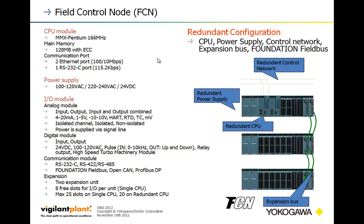There's a wide variety of I/O modules — all the typical analog types you'd expect: 4 to 20mA, plus or minus 10 VDC, HART I/O, RTDs, thermocouples, and millivolts. These analog I/O modules are high density compared to what you'd find on a typical RTU, and are applicable to both the FCN and FCN RTU chassis. For currents, voltages, and thermocouples you typically get 16 points per module, and 12 for RTDs. You have a choice of isolated, non-isolated, or channel-isolated. You can also run two-wire devices and power them through those two wires with built-in backplane power for true two-wire instruments.